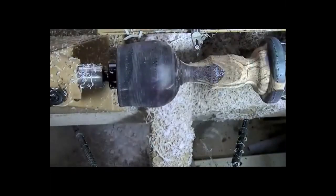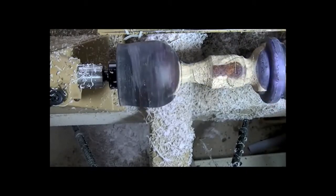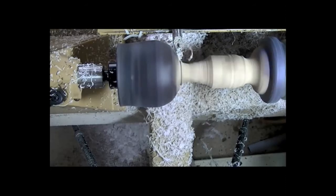The other square point one I use a lot for shear scraping or for creating the steps like I demonstrated before. And then the round nose one has a wide variety of uses, but it's probably the most versatile tool. This one, I mentioned in the last video, is useful for the dovetail cuts for your tenon or for your mortise. I really like it because of the fine details that you can get in on. They've got a really good weight distribution.